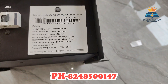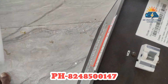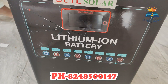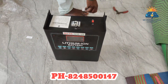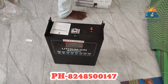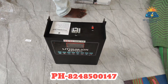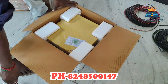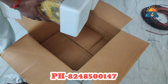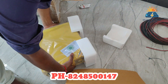If you have a 100AH battery, you can run a system with 4 lights and a ceiling fan. You can use backup. In this 100AH battery, you can use DOD — the depth of discharge. If you have a lead-acid battery, you can use 50% to 60% DOD. If you have a lithium battery, you can use 80–90% DOD. In this case, the battery is full.